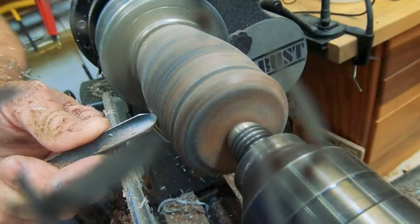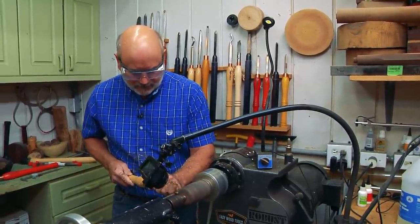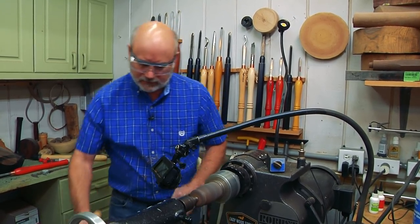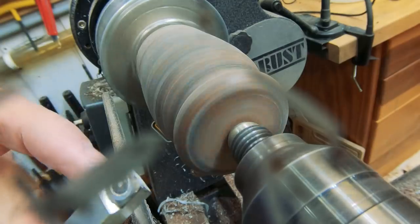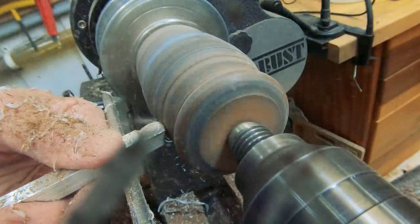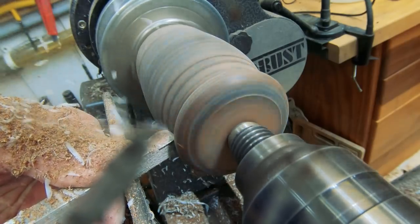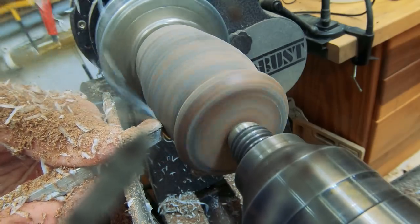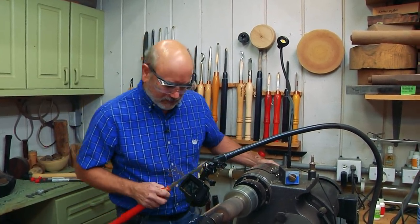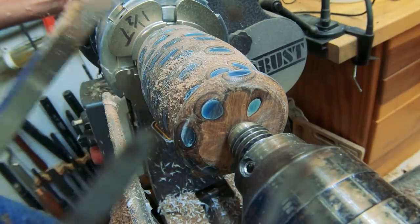Now when you're working with resins, carbide straight up will be a little chippy. But Easy Wood made a game changer — their negative rake carbide. This carbide tip rolls off on the edges, so when you come in and start using it on resin, it takes a perfect scraping cut and doesn't damage the resin. It does a beautiful cut — look at the feathers of wood and resin coming off. This is wonderful for putting a finishing surface on whatever you're making.